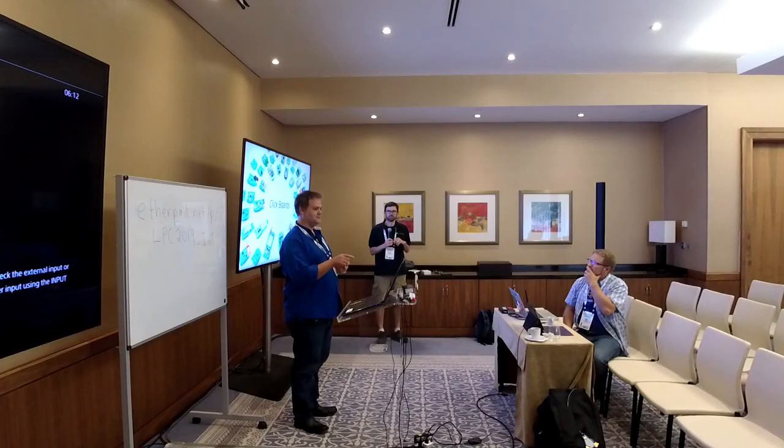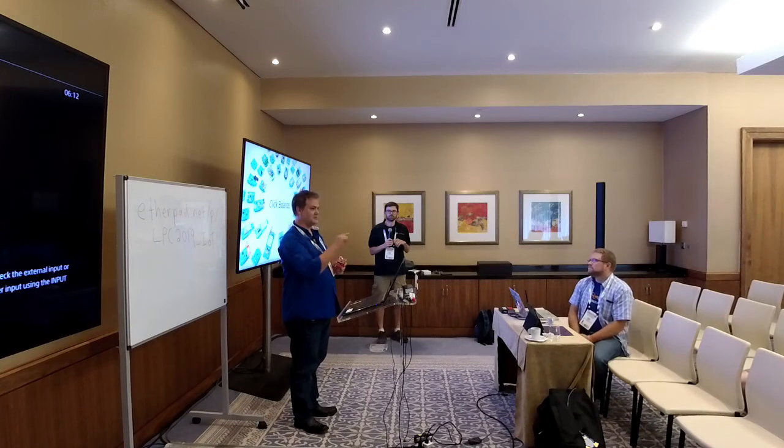Yes. Okay, good, so I understand that part well. My other question is: do you think we could find a way to get manifests from other kinds of daughter card systems, whatever the names are these days? I can imagine you put a small EEPROM on an I2C bus, which lets us have multi-drop, and all of your Pi HATs could self-describe that way in that manifest. The thing is, if the sensors are connected up to the bus of the Pi itself, then you would need something like GBSim still implemented in order to do the resource mapping, right? Yes, you could do that.